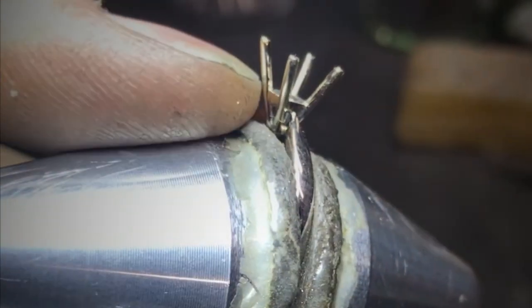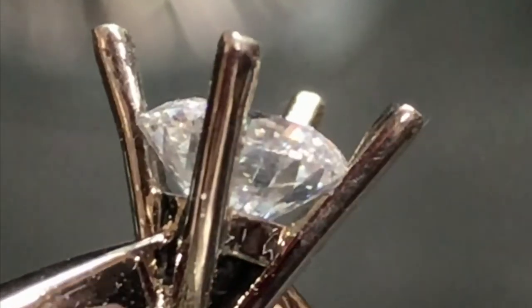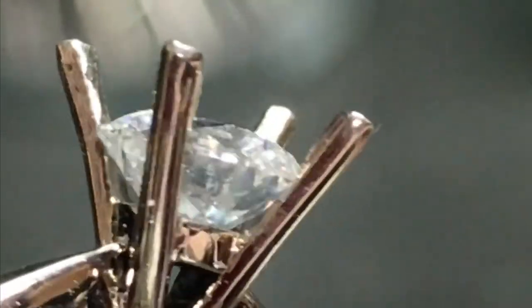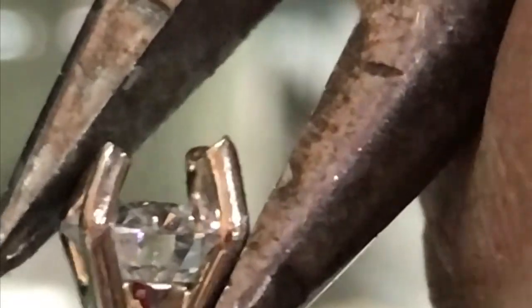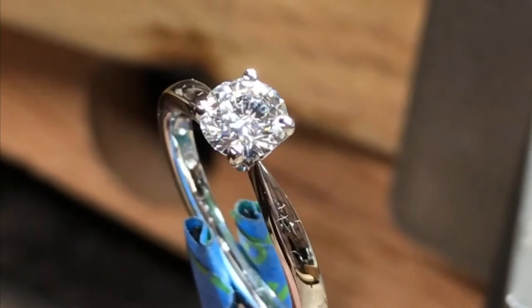I'll be dropping the stone in around there. Just about to set the stone right now. You can actually see the excess metal on the outside of that — this is what you're looking for. There was very, very little of that in the previous setting. So we know the stone is the right size for the setting, and the setting is the right size for the stone. If you've ever wondered how to set these, it's literally just a pair of pliers. That's it guys — thank you very much for watching the video all the way to the end. Like and subscribe if you enjoyed it, and I will see you next time.